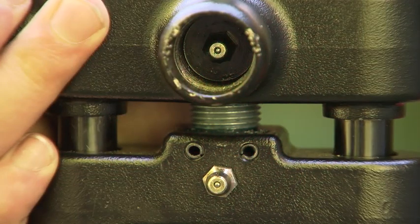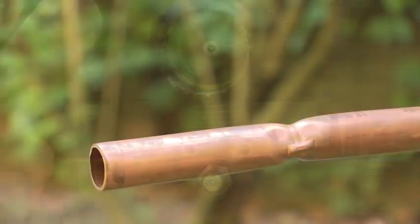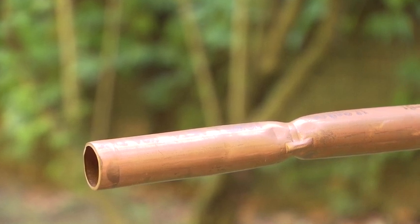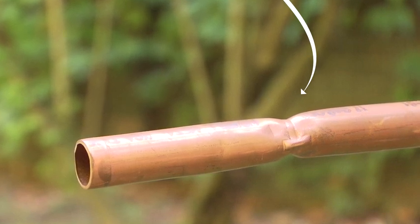Use the grease fittings for lubricating the feed screw and thrust washer to ensure long life of the tool. You may also want to consider installing a repair clamp over the re-rounded section to help guard against leaks. The shut off and re-round procedure could possibly damage the integrity of the copper tubing.